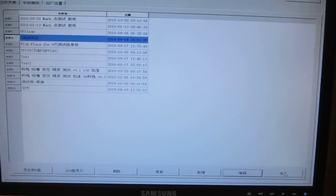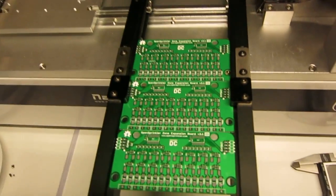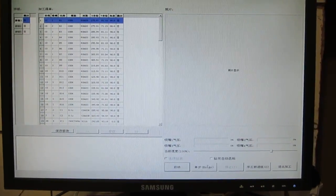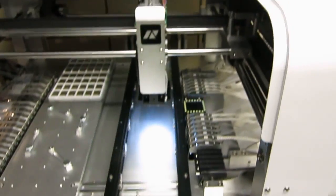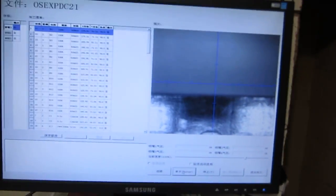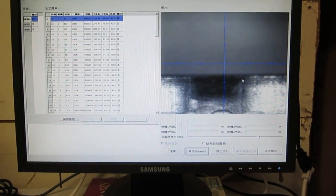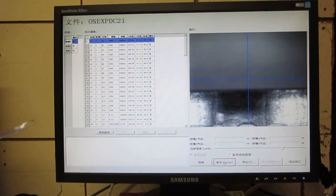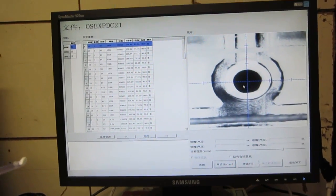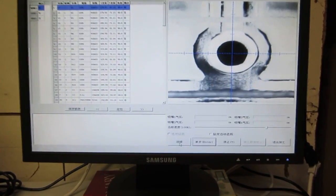This board is the OpenSprinkler DC-powered expander, arranged in a 3x1 panel. I'm starting in step-by-step mode — first it calibrates the pick-and-place head and then feeds the PCB. It located the front end of the PCB, and it doesn't need to be completely accurate because the next step is to identify the fiducial points. The conveyor feeding just needs to get it close enough to recognize the fiducials, then I'll let it run continuously.